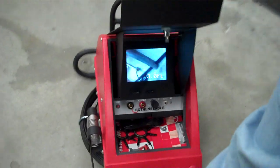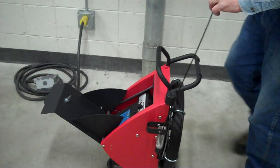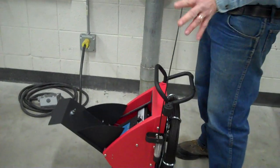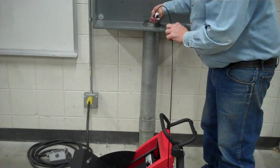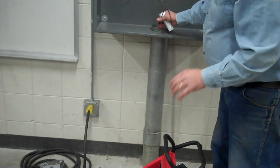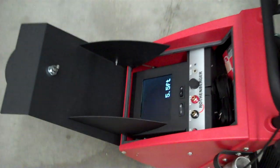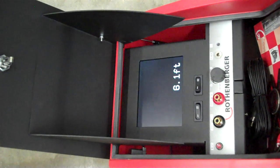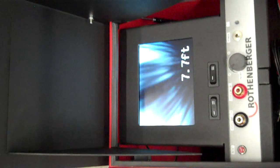This is going to help later in detecting it. I'm going to tip it up for use here. It's a Rothenberger mobile, so you can use it in any direction. And stick the camera down in the pipe. And if you look here at the display, you can see the markings of the pipe, like what you're actually going to see when you do and check out the sewer line.